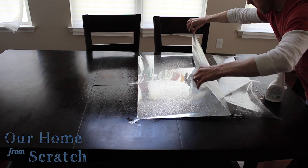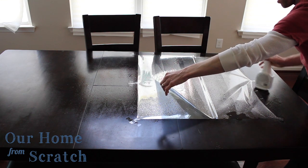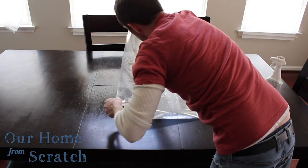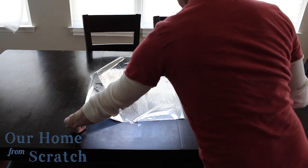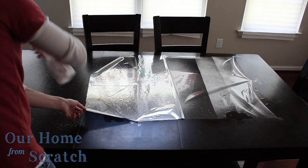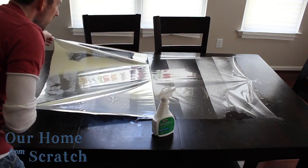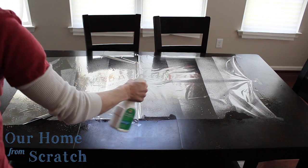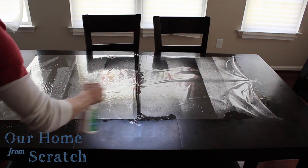This works great with two people — one pulling the tabs, one spraying — but by taping it to the table this way, it allows you to do this by yourself. This is now a one-person job with this taping technique. I keep pulling on it and every few inches I lay it down on the wet surface. Because both the table and the back of the film are wet, it's easy to separate and won't stick — a lesson I learned the hard way. I just liberally spray all over the table; it's not going to ruin the wood. You can see it separating. The part I'm pulling off is what goes on the window; the part tacked to the table gets thrown away. I completely pull them apart and both sides should be sopping wet — that's how you know it's good to work with. If any part is dry, it's going to want to stick to itself.